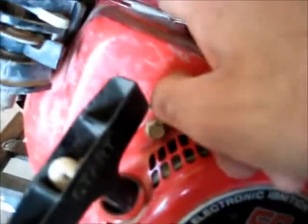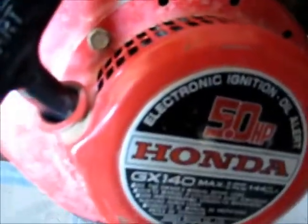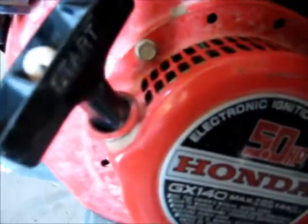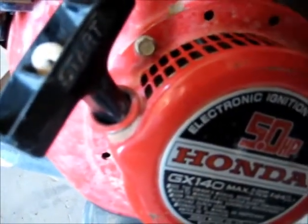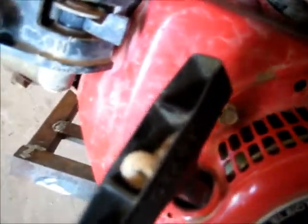That little spring there nicked and got caught behind that bolt, but I fixed that up real quick smart. Luckily no damage was done. It was one of the main throttle springs. It's lucky that wasn't damaged, you've got to be careful of that. Watch where you're putting the cowling back on. Other than that, it should throttle just fine now.